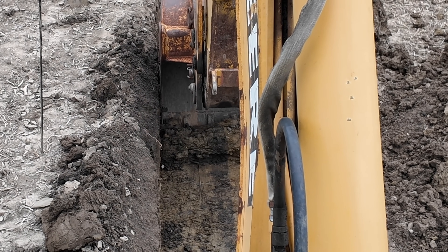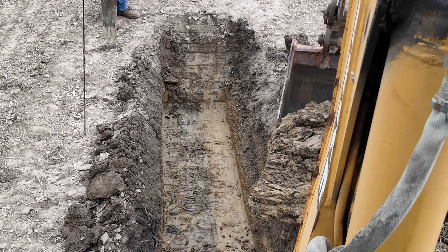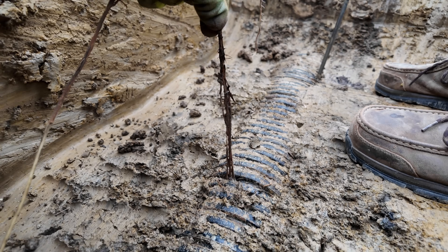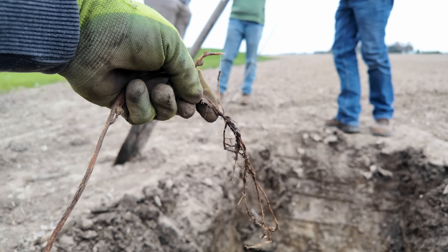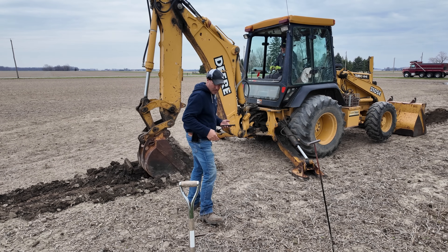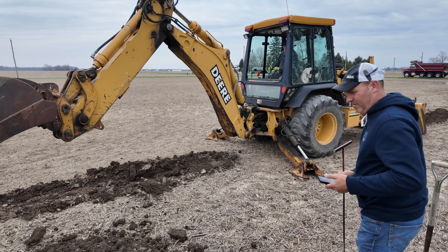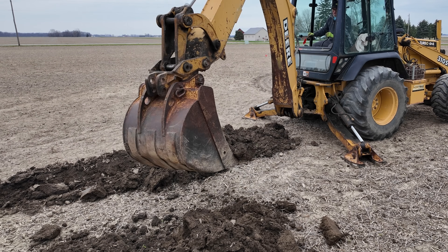It's probably full clear down to here — I can see a tree root. We've got water here, which tells me those roots are originating inside. I'm going to separate the topsoil from the subsoil — put the topsoil over here on this side to save it and put back on top, and all the subsoil I'll put on the other side of the trench. It's a little more effort but it's better.